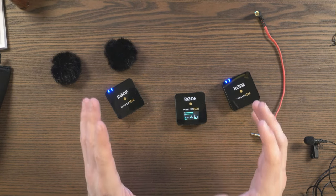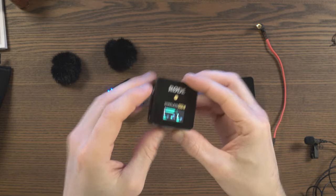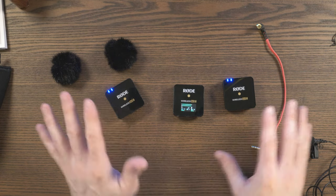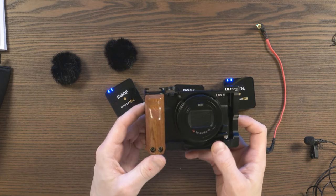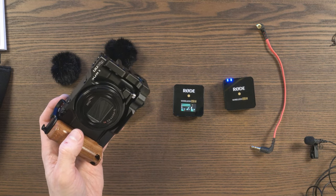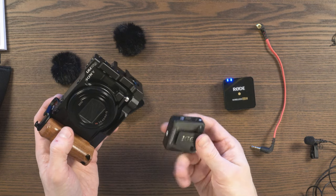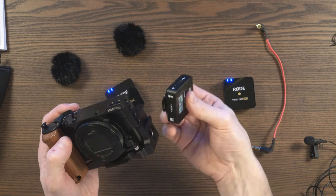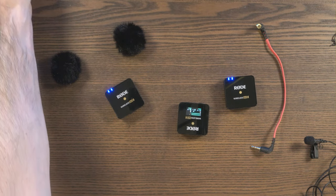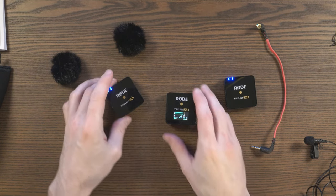At this point you should have a good general understanding of what the Rode Wireless Go 2 can do - what the buttons do, what the user interface means, what all the symbols mean. What I recommend is spending about 20 or 30 minutes just playing with it, changing settings, pushing buttons, and doing lots of recordings. You have to set this up with your camera or phone or laptop or camcorder. You might set the gain at 5 out of 30 and the pad at minus 24 for one camera, but for another camera it might be minus 12, and for a smartphone it might be completely different. Things always change in audio recording and things can and will go wrong.